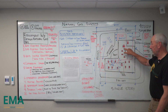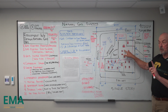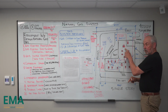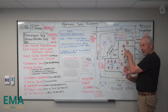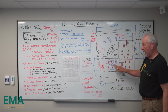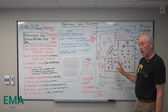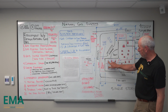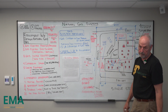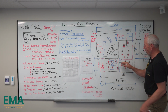Now you've got to coordinate these bigger units to make sure that you're not, condensate's critical. Drain lines cannot be smaller than the actual tie-in. So if it's 1.25 inches here on a condensate, I change systems, you can't reduce it and go 1 inch. Gas you can if the table's saying it's okay, but we don't go smaller than 1 inch. Even if it's a 3/4 on a rooftop, we still run a 1 inch, and they just reduce it down. Does that make sense? You're basically sizing it the same way.